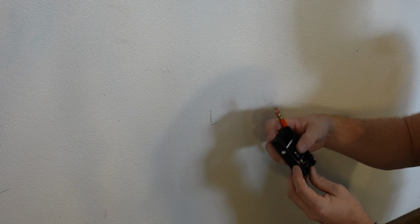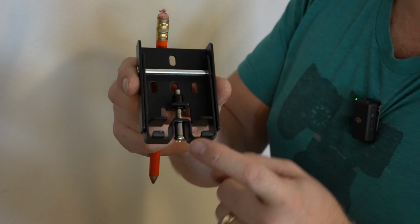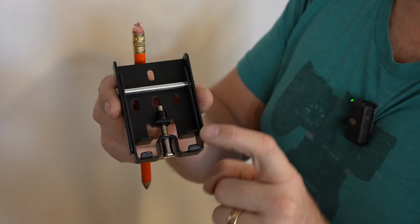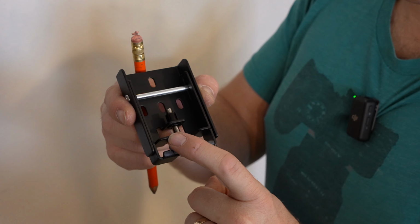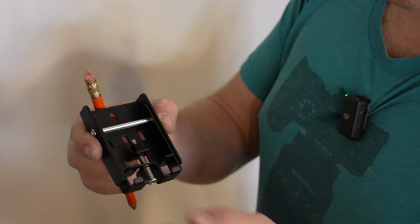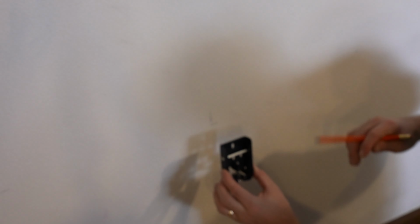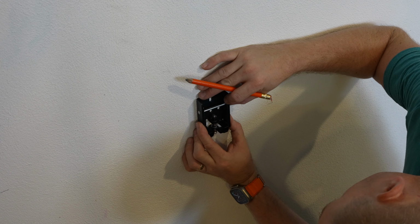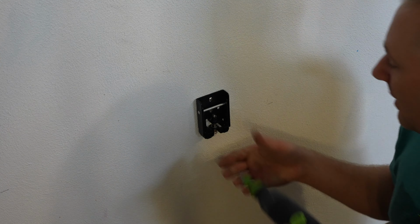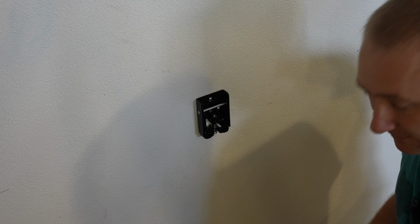Essentially, I think what it is, I don't know how well you can see this. There's the bottom actual lip that clamps. Then there's this tooth right here. I think that's where the 58 1/8 is, this tooth, not the clamp, because the clamp's going to go up and down. It's actually going to clamp it into position. So that is what we want to go by for that 58 1/8. Just like so. See my stud line? I think that's my item. So our frame should sit in here, and then we can tighten this clamp and clamp it down. Okay, I'm going to do the other side.